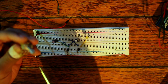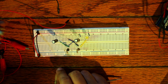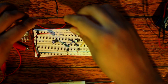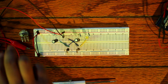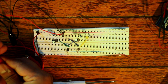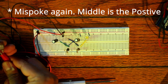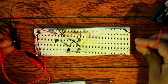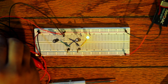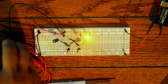The potentiometer is going to increase and decrease resistance. This one says B10K — I'm not sure if that stands for 10K resistance, but that's pretty much everything. We can plug it up and fire it up. With the negative going in the middle, we plug in the battery, we see it light up and oscillating. If I turn the knob a little bit, you can see it get a little faster. If I turn it all the way to one side, it seems to be steady.